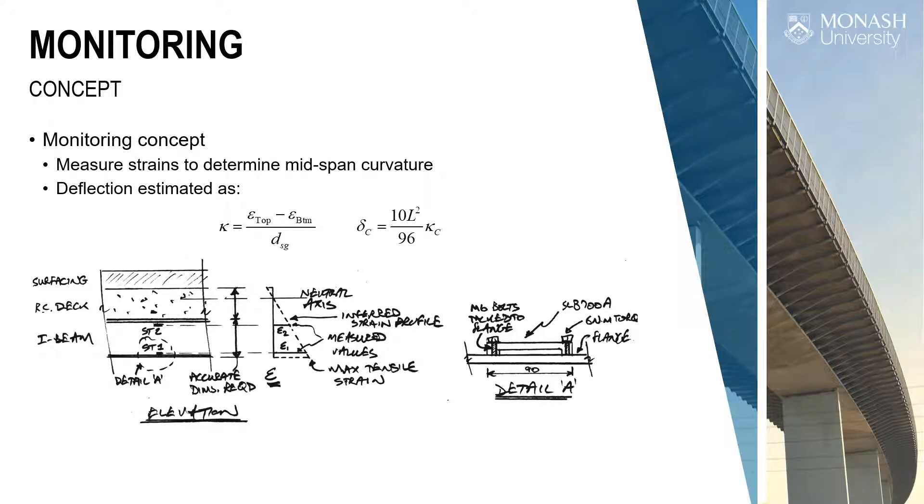This was an unusual arrangement, and it meant getting the truck drivers to drive off-centre, which they weren't used to. The solution on this bridge was to use strain transducers on the top and bottom flanges of the steel sections. The idea was to convert the strains into curvature — the slope of the strain diagram is curvature — and curvature can then be double-integrated to give deflection. So we were giving them deflections, but we weren't actually measuring deflections.